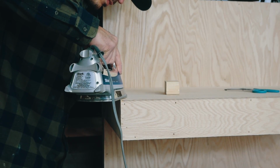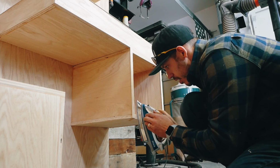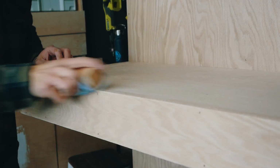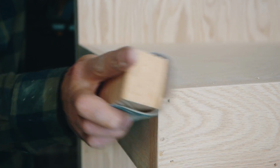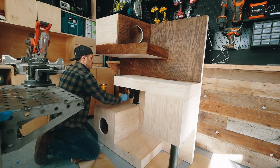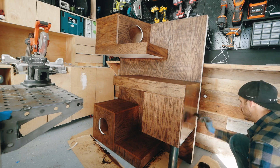As part of the finishing process, we're gonna edge band all the exposed ply with the red oak finishing edge banding veneer. We're gonna iron it on, trim off all the excess, sand the edges flush to make it nice and smooth, and then examine the entire project and find where all the brad nail holes are from the assembling, finishing off with the wood filler that's stainable. Then sand our entire project down with light 150, very light, don't take off the veneer, and then 220 to finish it all off, and then stain.